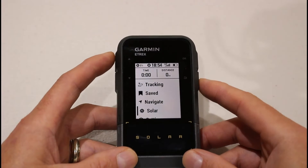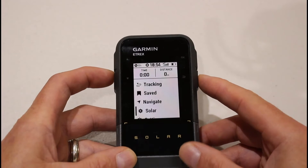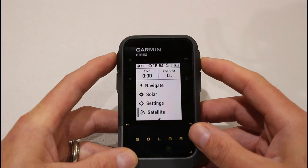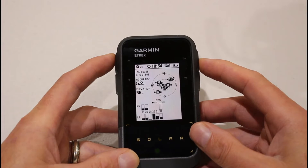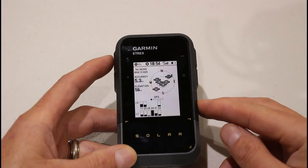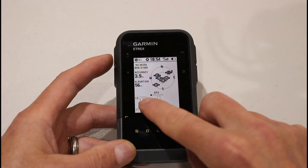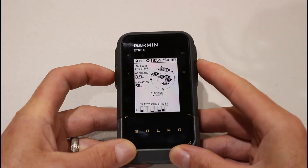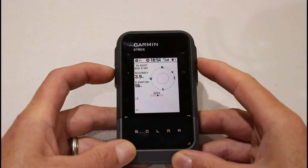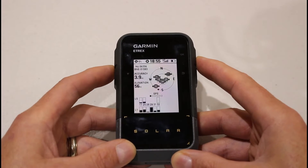The other new feature of this device — beyond the built-in lithium battery and solar screen — is multi-band dual frequency GPS. Rather than just multi-GNSS where you're picking up more than one satellite constellation, as on the SE device, this device also picks up multi-band signals. So there are two frequencies of signal being transmitted from the satellites. On the satellite screen I can see I've locked on with 3.8 meter accuracy inside the building, with GPS L5 and L1, GLONASS, Galileo E5 and E1, QZSS, BeiDou, and NAVIC satellites.